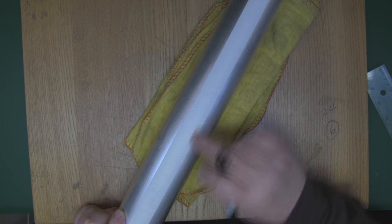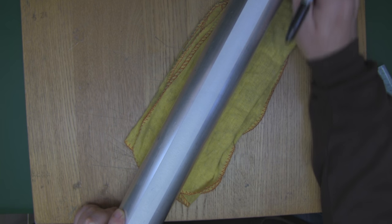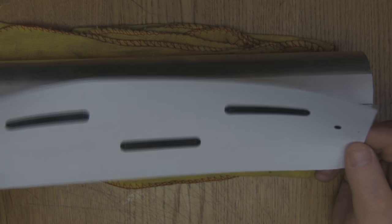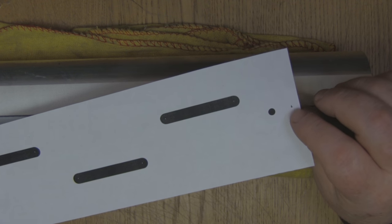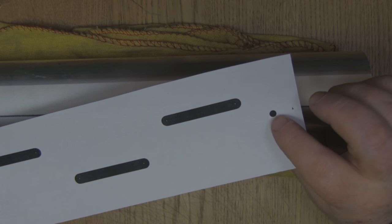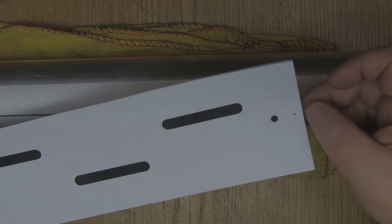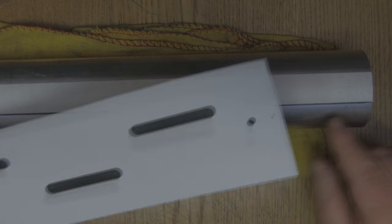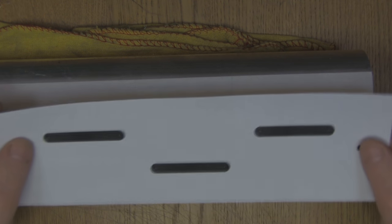When I lay the template on top I should be able to see that black line through the paper and lay it down on the tubing nice and straight and uniform. I've placed a small black mark 14 millimeters from the center of the feed point circle, so I can line this up with the edge of the tubing to confirm the distance is correct, and then see the black line through the template to keep it uniform all the way up.